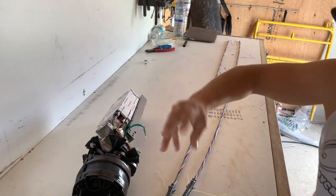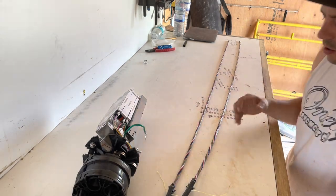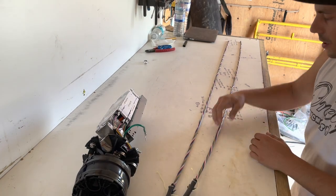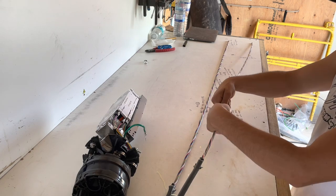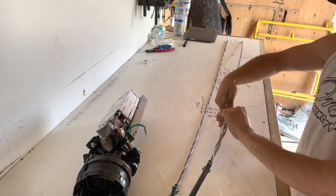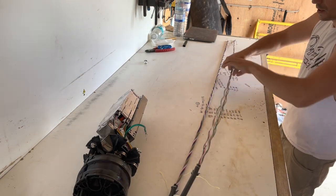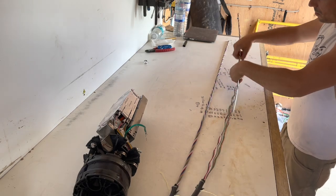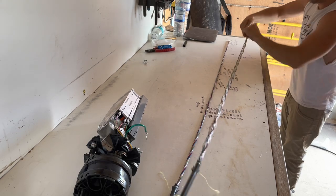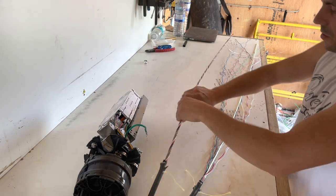The cable will twist back and forth, twisting this way around the strength member to the helix, and it flips the other opposite way. In order to get this off, the easiest, most efficient way, don't go to the end, come right to the first helix, grab with both hands and start twisting, but keeping it in the same order until you get there. Boom. Next helix. Give it a twist the opposite way. Boom. Final one. Just like that. Do the same with the other.